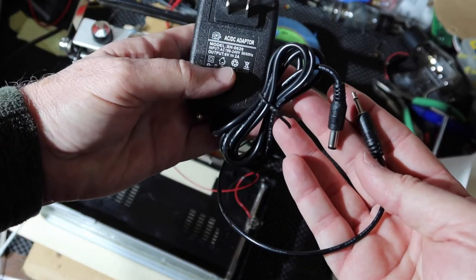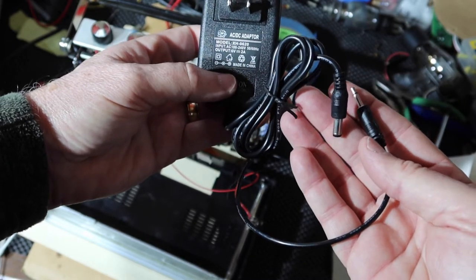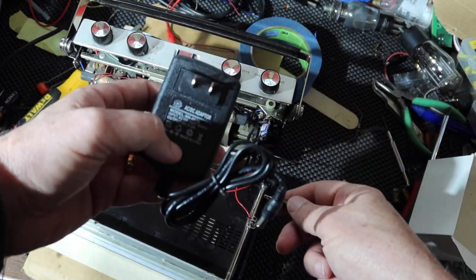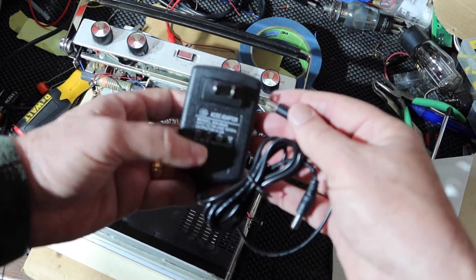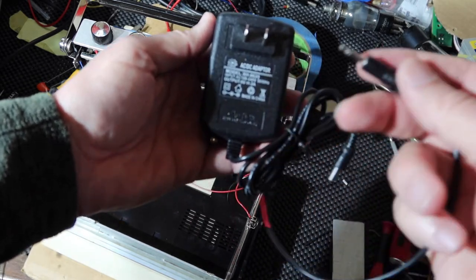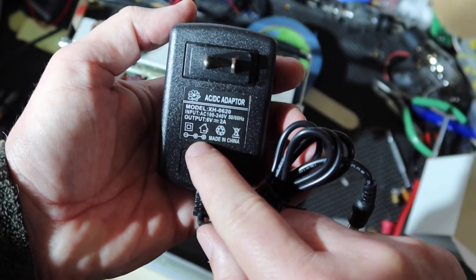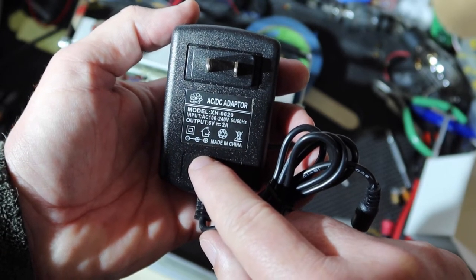I could change this marking, but I've decided, bear with me for a minute, I'm going to explain it. I'm going to leave it like this. So I'm going to wire this for a positive tip. The chassis, by the way, is plastic. I've done continuity checks between the battery terminals and whatever piece of metal is fixed out. There is no continuity. So I'm going to wire this in accordance with this color and in accordance with this polarity, so that this will always be marked correctly from what's on the tip.